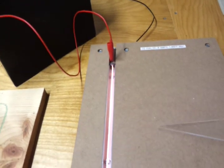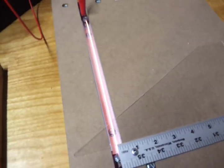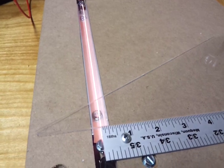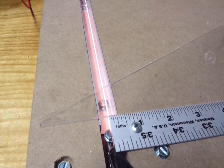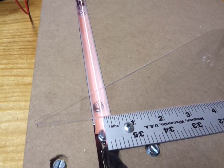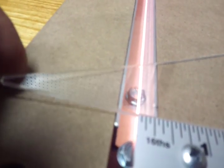You can take a piece of plastic and put it over that, and you just do that for a little while. You can see the wire nice and hot there — it's going to heat it up. It's actually not contacting the plastic; it's right below it. And you'll get to a point where all you have to do is start to bend.